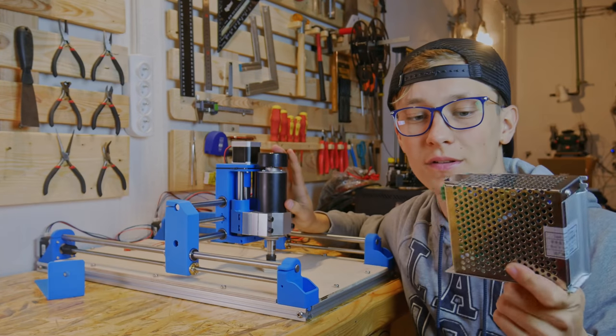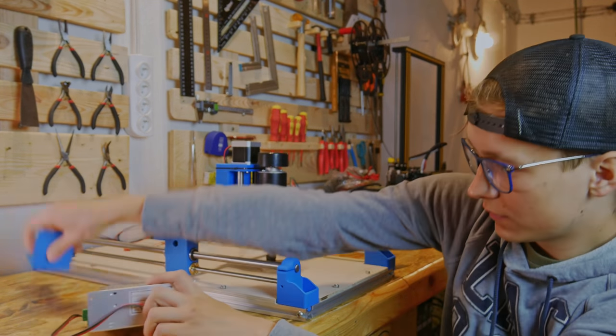The power supply for this spindle is quite big and bulky, so I designed a very simple holder. You can put the power supply right in here, and there is a place for the potentiometer which controls the speed of the spindle. You can then attach this holder to the side of the CNC machine, just like the electronics box. I'll also drill a hole in the aluminum profile to connect the power supply cable to the spindle and run it together with the other cables.